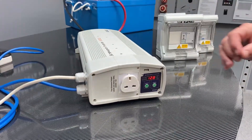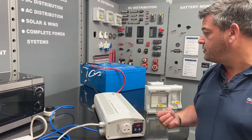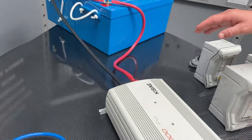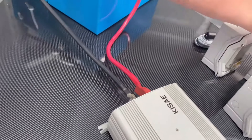This makes installation much easier but it also makes operation of the inverter completely automatic. We'll come back to this in a minute - what we're going to do is just review the installation and then we're going to see the unit operating. So at the rear of the unit we've got the main DC connections down to the battery - main positive and the main negative onto our main battery bank.